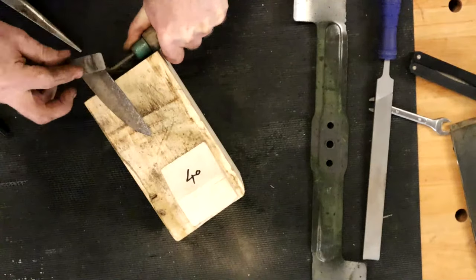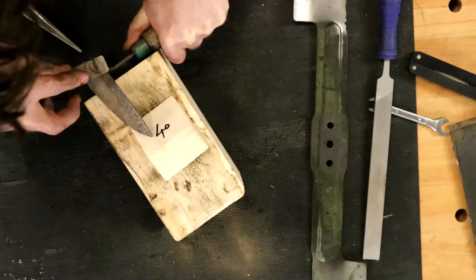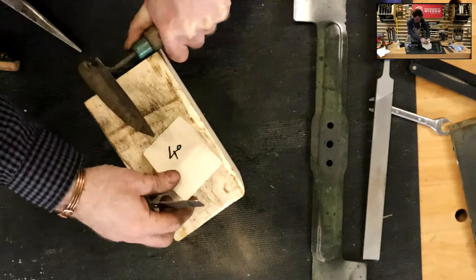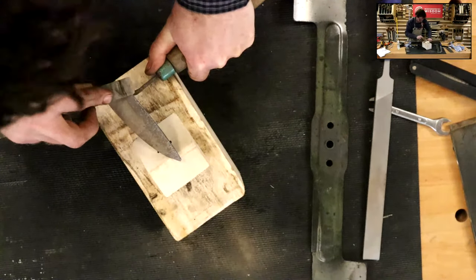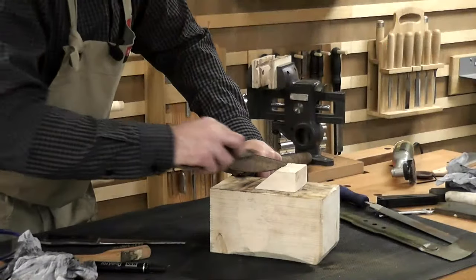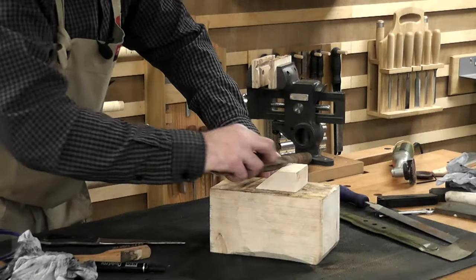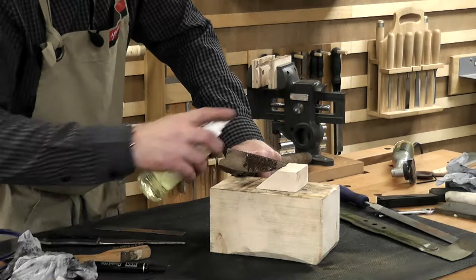Work across. Now I've got a sharpened edge on here. And again, by getting myself stable, I'm putting it on something, not rocking a bit. I could come up to there. It might be even better, just trying to see where we are on camera. Work down, push along. So your little diamond file again, just taking a minute amount on there. Now, I can't imagine trying to do this on a grinder. Let's have a little bit of oil.